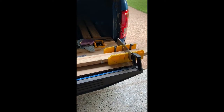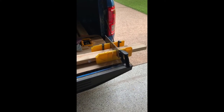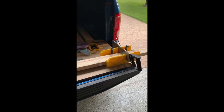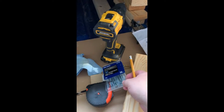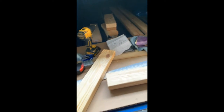I don't have a circular saw or anything like that. I did have a jigsaw, but it's actually easier and quicker to do it by hand and more accurate — get the straight cuts. I also have to do some angled cuts, which this miter box will help with. It has a 45-degree angle and other angles that we can utilize. I have a drill and I'm using number 10 screws — two and a half inch — and also some three and a half inch for my diagonals on the two-by-fours.